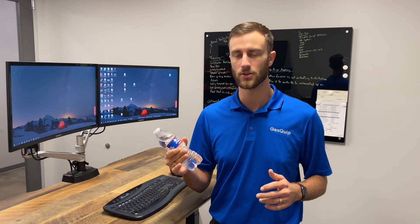The most common form of contaminant within an SF6 breaker is water. So if you have water inside the breaker — moisture — how do you get it out? Well, the most common way of doing this is to pull vacuum, or perform a vacuum dryout on the system.